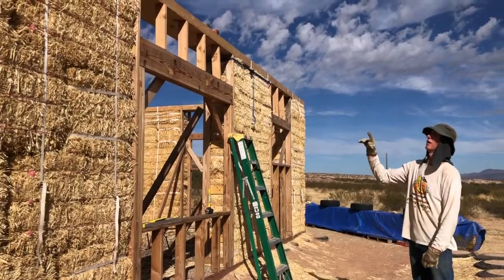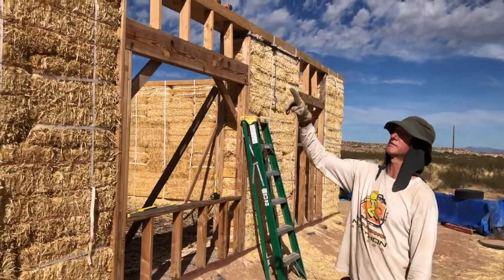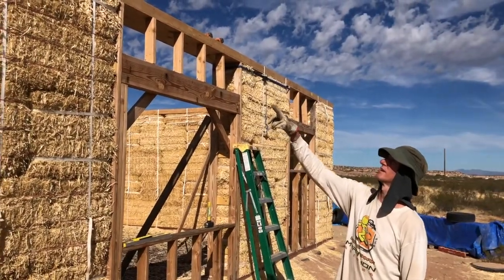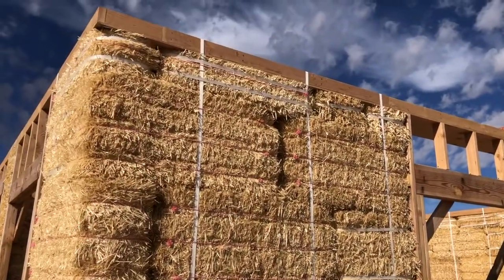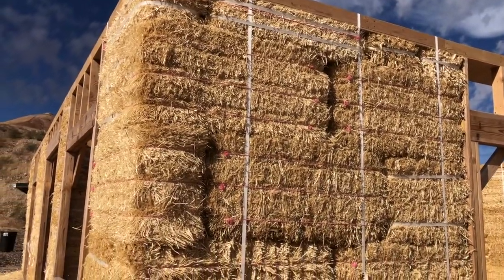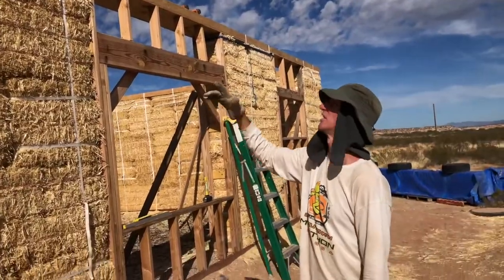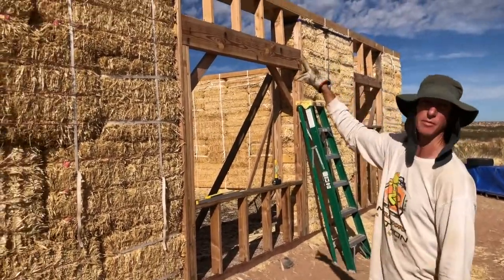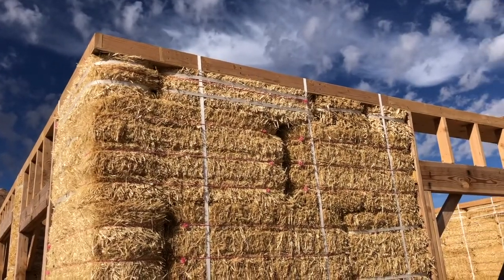So, you know, unfortunately, I spent several days, actually, chainsawing, basically shaving that top bale a little bit while it was in place, because the box beam didn't come down everywhere the same amount. Right. In several places it did hit the buck, but then in some places it didn't, so I had to take more straw out. Okay. So that took a little while.